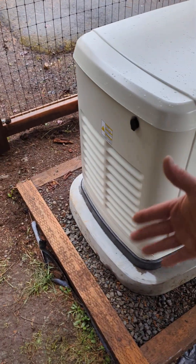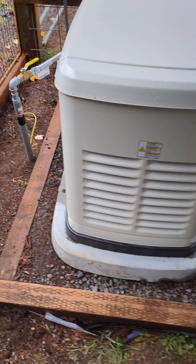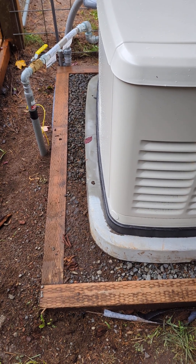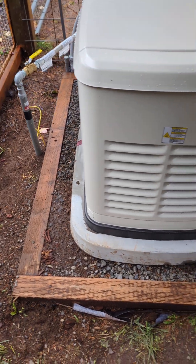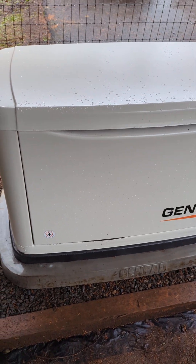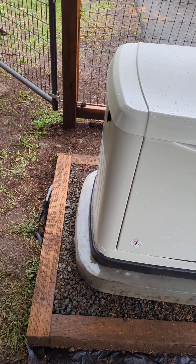This is the exhaust. You've got to keep a minimum three feet of clearance, and the gas guy did a pretty good job. It does not appear to have a sediment trap, but I will reach out to him on that. Other than that, if you liked the video and have any input, hit us thumbs up, subscribe — smash that button. I hope you got something out of it; come back for the next one.